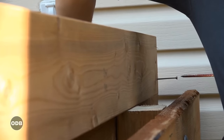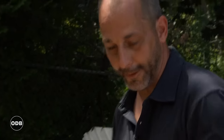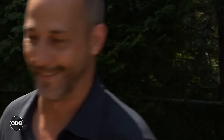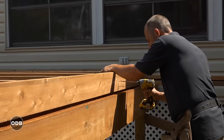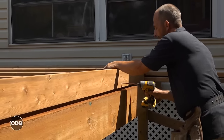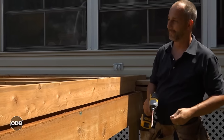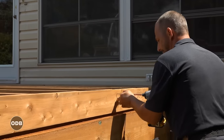When you're working with 2x6, it's one fastener for every 2 inches of lumber in the number — so 6 divided by 2 is 3 fasteners. Make sure you do it or when your inspector comes by, he won't pass you. For this particular project we're using the Sienna brown pressure treated. You still have the green on the market in certain suppliers, but this one looks a lot more like cedar — it starts off brown and within a week or two of fading in the sun you'll never know the difference.